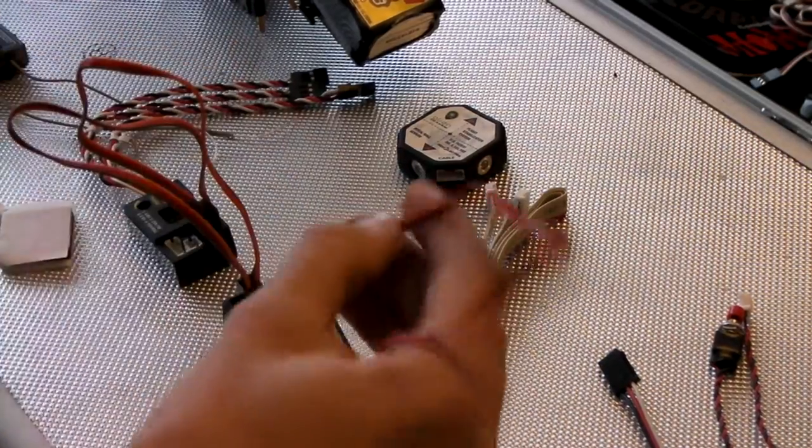I'm just doing a quick mock-up of the system, and we'll just get it all fired up, making sure everything works before you actually fit it to the helicopter. So I've now plugged that into the receiver. So we have the CL1 unit and the Alien Command, which is basically this system here. We're just going to go through that and double-check everything. We have our pitch, which goes straight to the CL1 unit. We have the Elevator and Aileron — channel 1 and channel 2 — which comes from the Alien Command.